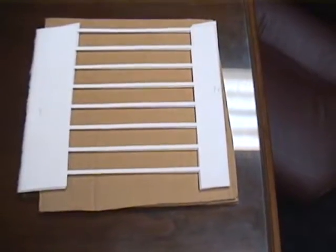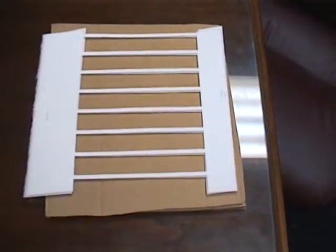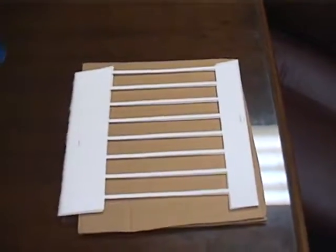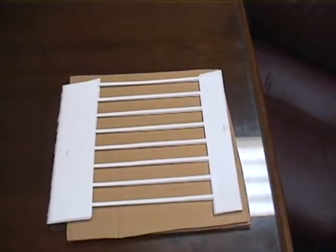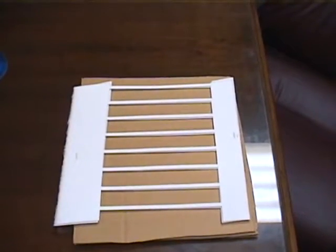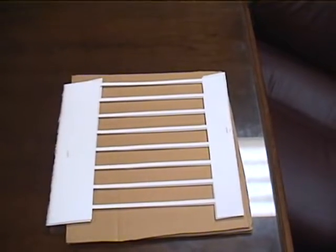This is the sample being sent to you — I've stapled them together. This is the actual top — I'll mark that as the top — showing the repeatability of one section to the next in the machine. This is why we feel that what we're offering with the hitch feed, with the difficulty you're going to have in some of these knockout systems and doing multiple hits or multiple knockouts, the hitch feed is going to be the best way to go to maintain that repeatability that you're not going to be able to achieve in a nip set.